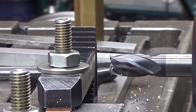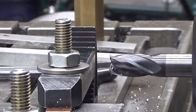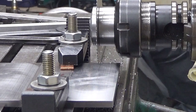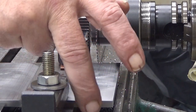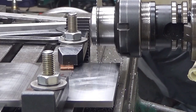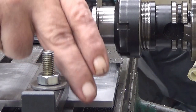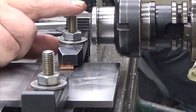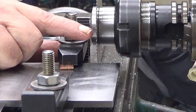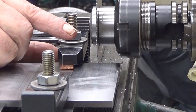Well, yeah, another mirror surface there. Now I have this, the first surface we did, and here on the back side is another. I have dialed this in so that, as far as I can measure, it is perpendicular. As you can see, it's no more an end mill, and this was actually the reason why I have this horizontal milling setup. So I can do this.